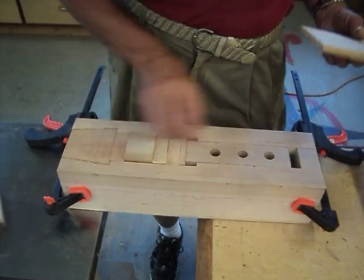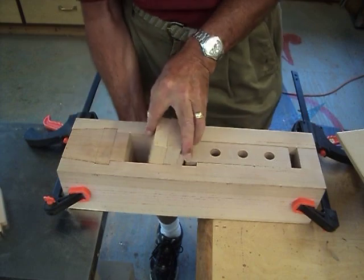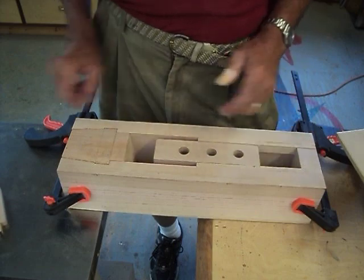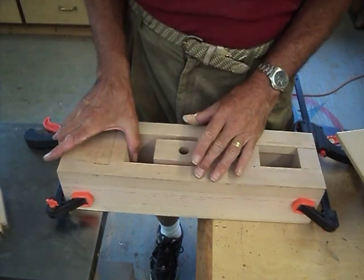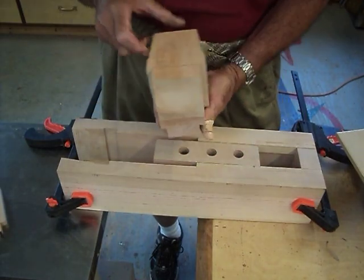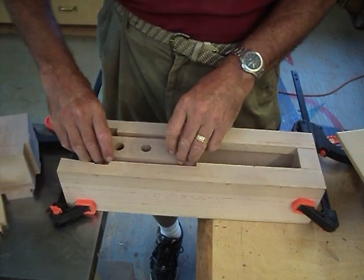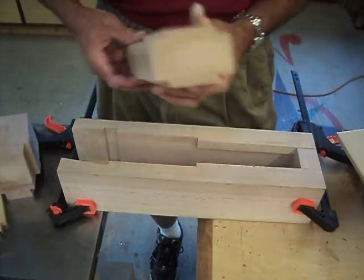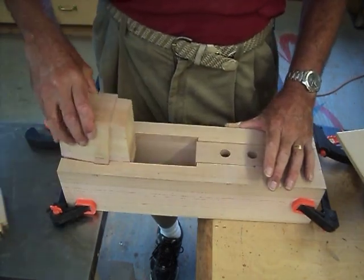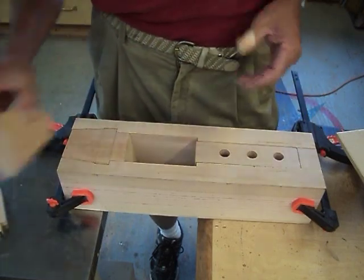So in fact I've got three and a half inches of travel. This pops up from the bottom, these pop out. Should I want to — if the wagon gets sticky or anything like that — this will be trapped in the bench; right now I just have a clamp on it. But I can lift this block out, which is kind of interesting. It's a modified deck beam joint. At that point I can slide the wagon back and lift it out, clean things, replace the wagon, drop the deck beam joint back in. It'll be snug because it'll be trapped in the bench.